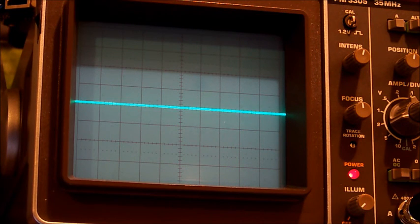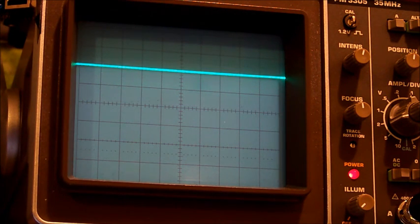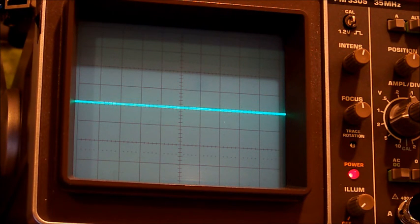Now what I have is 3 volts on the inputs. I'm getting 3 volts on each of the outputs like that. Well, just over 3, and that one was 4, give or take. No variation of input signal. So I think we may need to trace it back further towards the source.